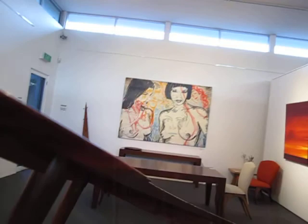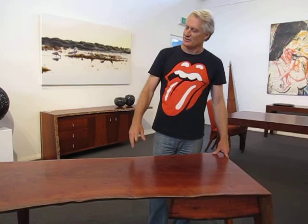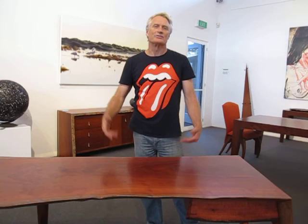I've used an oil finish on this, which is a new oil I've been using called Kunos, which, similar to the other oils I use, is totally organic, so it's nice to use, it's safe, there's no odour, and you just get a really nice sheen with this Kunos, and it's quite protective. It's actually made for bench tops, so you can spill things on it after the first 4 weeks. Once it's cured, it's really resilient. So you get a really nice luster to it.